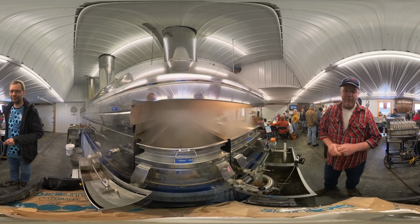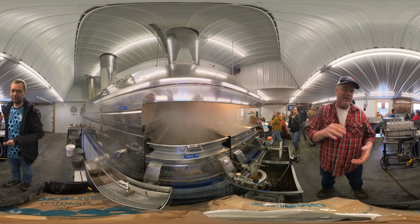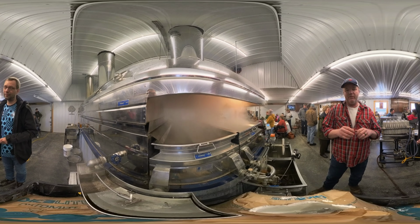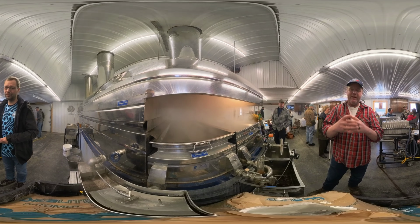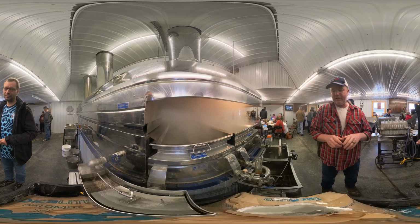Once we have it right where we want it, we'll mix it with diatomaceous earth. Diatomaceous earth is ancient algae that has settled in layers of old seabeds. Those algae have a silica shell around them, which creates a kind of porous filter. They get all blended together. They'll filter out very fine microns of impurities.